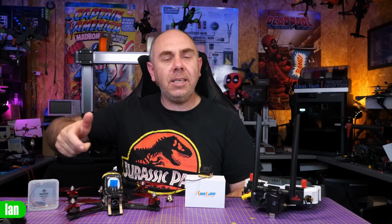Things like the variable MCS rates may massively help with that, because what it will be able to do is change the bandwidth, change the link settings to maintain the latency rather than it fluctuate. I've got no data though around that latency fluctuating. All I can tell you is I have a feel that there are times the image judders or the image changes and I just feel a bit disconnected from the quad, and that has to be latency. There's nothing else that can be.